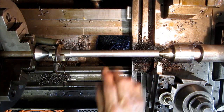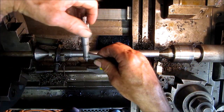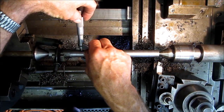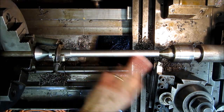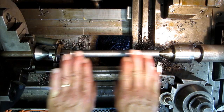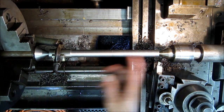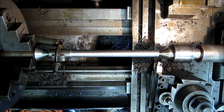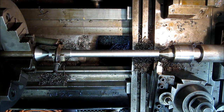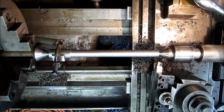Okay, we're about 20 thousandths over on our diameter and we're pretty uniform — about 77, 78 — within 1 thousandth. A little heavier here than we are here, which doesn't matter. We're going to be machining from here to center, then when we flip it from there to center, a little heavier in the center is no big deal. So put that chuck wrench down, Mr. Fenner — you're not going to take that out, and don't make that mistake in the middle of your project.